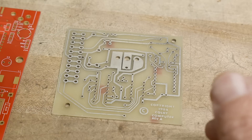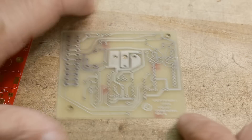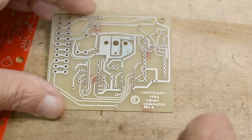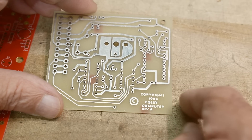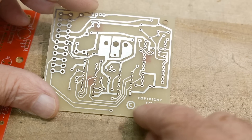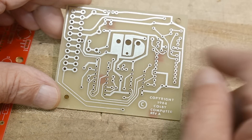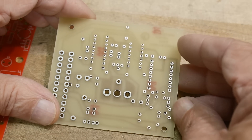If you don't have the ability to put nomenclature on a silkscreen, you could always etch it right on the board if you had real estate left over. Very often the only thing you'd see written on boards is the manufacturer or part number. You wouldn't have any way of knowing — is this R1? Is that R2? You just wouldn't have any way of knowing that.